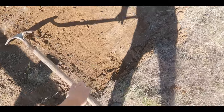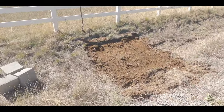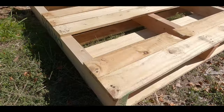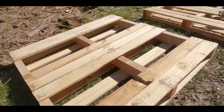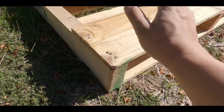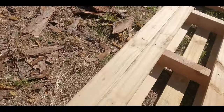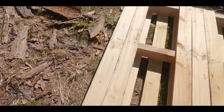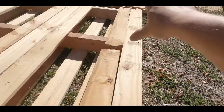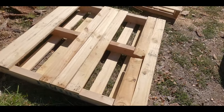The bones of the firewood bundle stand is going to be primarily constructed of pallets. We're grabbing one of our four pallets and starting the build of the base or the bottom of the stand. Here I've got the backside or the underside of one of these pallets, and what I'm going to do is remove with my sawzall this outer piece on this side and the outer piece on this side. That way I'll be able to secure one of my 4x4s to each corner, providing the base for the firewood bundle stand.